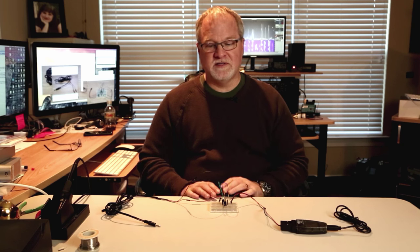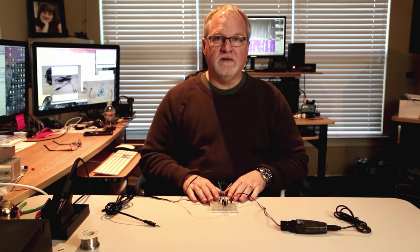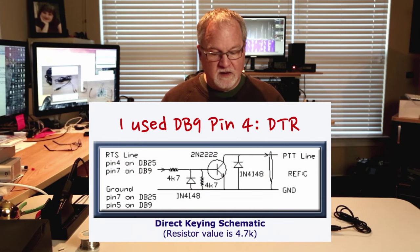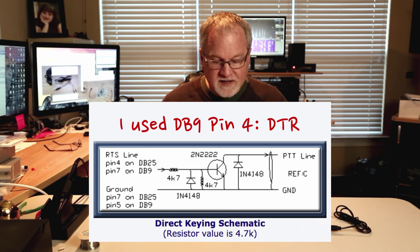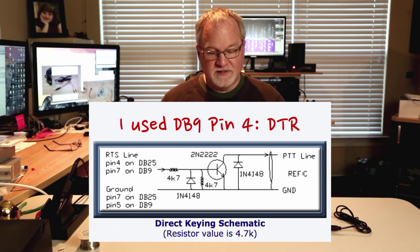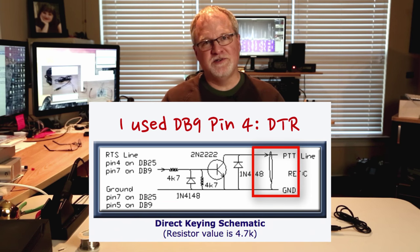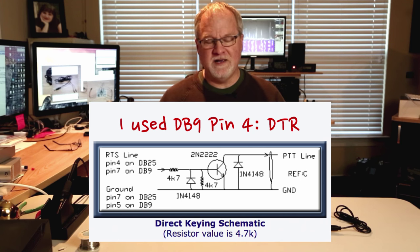So let's look at this and talk about the parts that are here in front of you. First of all, I got this circuit from a circuit diagram on Scott Davis's website, n3fjp.com. And there's really not much to it — it's one transistor, looks like a couple of resistors and a couple of diodes, and that is it. So you have to have a way for the signal to get to that circuit and a way to do something with the closure of those contacts that the transistor makes, so you can key the radio.